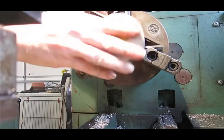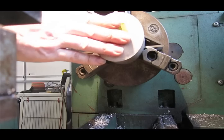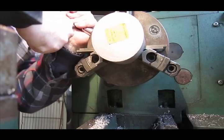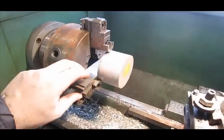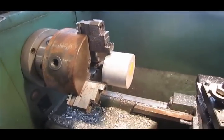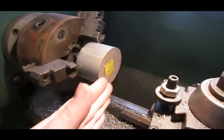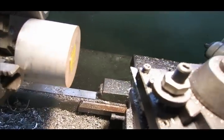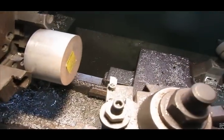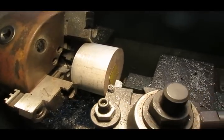I put my piece of stock in and press and hold it against the parallels, then tighten the jaws down so it's snug. I do not want to turn this on while the parallels are in there because it will fling them out. Now that the stock is in the chuck, the first thing we're going to do is face it off. A facing cut is perpendicular to the axis of rotation — this is just a saw-cut edge. I've got my tool bit in here just a little bit at an angle so that it will clear as it moves inward, and I'm going to machine it off.